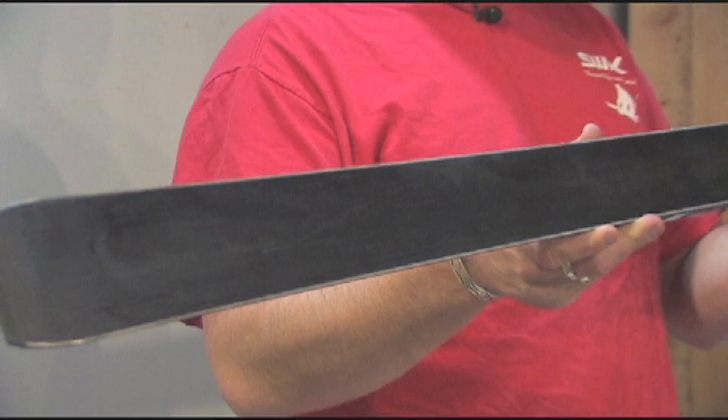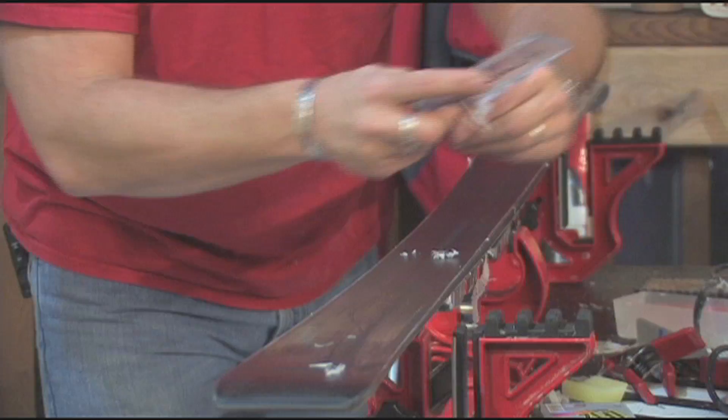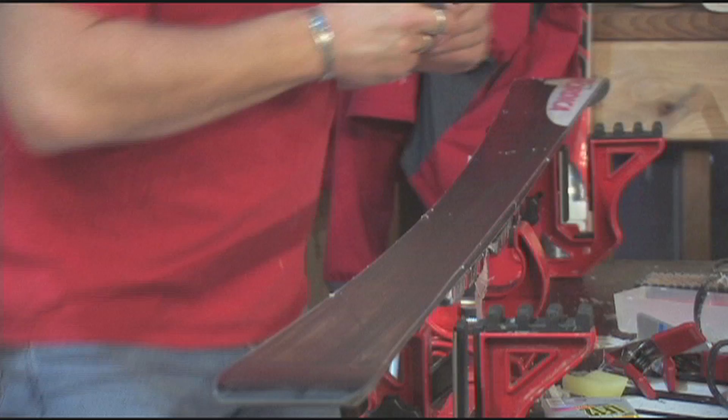But then we're going to let it cool — 20 minutes; overnight's better. At this point we're going to take our scraper. So here we're just going to go very smooth. When I hold the scraper, thumbs here, nice even pressure. The scraper should be sharp enough where you don't have to push down too hard. That's the real thing that you're looking for.